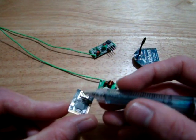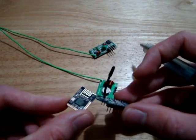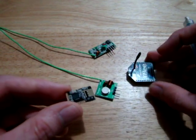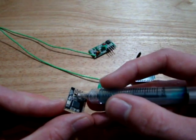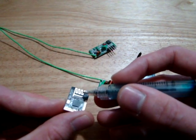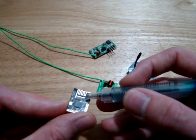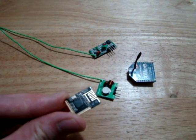See, the first step that they did was they took a monopole and they bent it over to make a shorter antenna. So if you ignore this grounding stub, you then introduce a capacitive element, so you counteract that with this grounding stub to get a pretty good antenna.